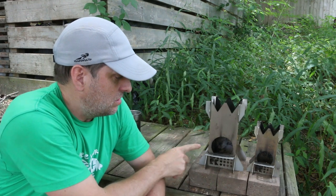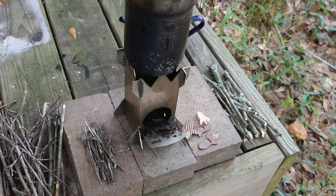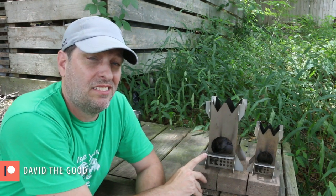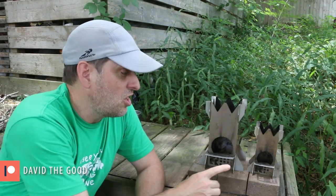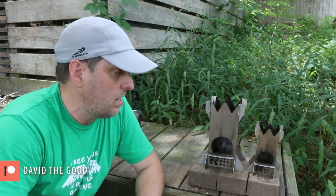One of the things I've always tried to do with this stove is to improve it. The first stove was this size, and then I came out with a micro, which is about 70% scale of the full-size stove and significantly lighter. The first version was 16-gauge, which was far too heavy. This version is 18-gauge, but about a year ago I switched to 20-gauge for the micro to lighten it up. I want to see if I can do 20-gauge for the full-size stove as well.